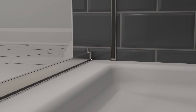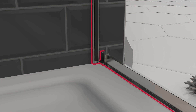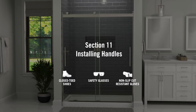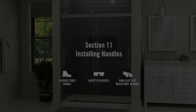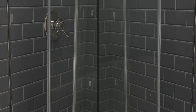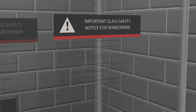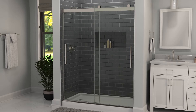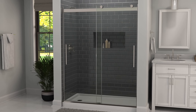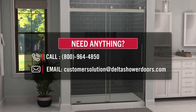Remove the final corner protectors and install both blade seals, with each blade facing the other door. Use silicone to seal the inside edges of the side jams, dam strip, and center guide. Disassemble both sets of handles, then reassemble the handles on the door, ensuring all gaskets and bushings are used in order to protect the glass. Once screws are hand-tightened and fully secured, add screw covers to the handles. Lastly, there is important safety and usage information on the glass shower door sticker — the door's user or owner should be allowed to read the information before the sticker is removed. And there you have it, a brand new shower door to completely revamp your bathroom. If you have any further questions, call this number.